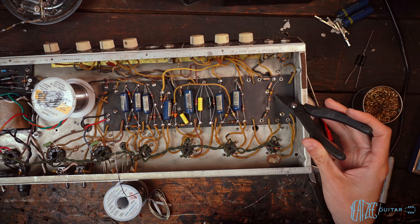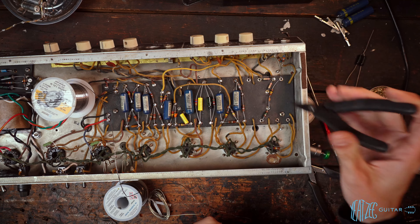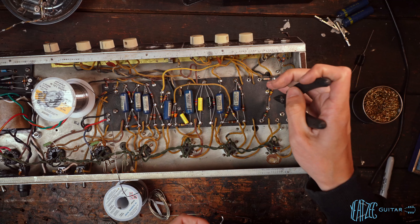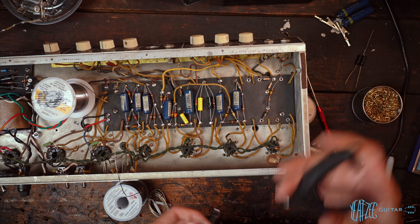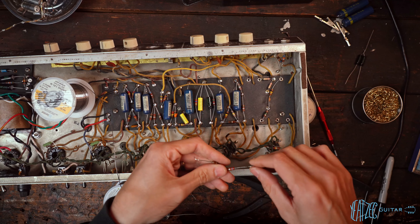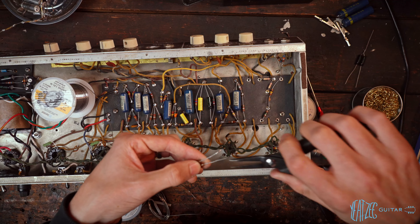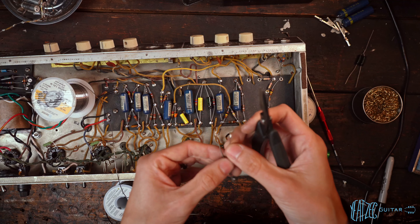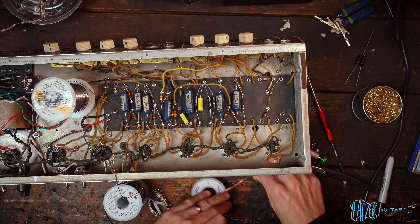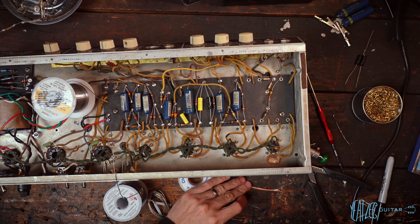More progress has been made here. Unfortunately the 100K that was in that glob was just unsalvageable. That's all right — I've got a bunch of new old stock Allen Bradley 100Ks, so no big deal. That's installed. I've got the two carbon film 27Ks installed, the 100 picofarad installed, the replacement 1 meg — also new old stock Allen Bradley. And then the 1.5K cathode resistor and the 2.7K — these are both in decent enough shape and are salvageable. The 100K just wasn't. We're going to go ahead and bend these leads a bit straighter. This amp's not the prettiest in the world, but we're going to have it be nice and functional. We're not too stressed about making it visually 100% perfect because that would require more or less a total rebuild, but we're making good progress.